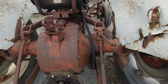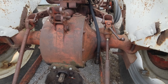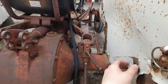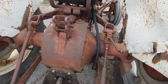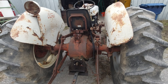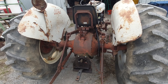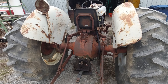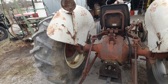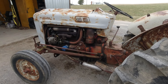It also has a functioning hydraulic input. The only thing with this hydraulic is it's a one-way kind of thing - basically a one-way valve. What that means is the hydraulic fluid is either pushed or pulled, and that's it. Think of it like a water bottle - you fill it up or you empty it, not both. Some hydraulic cylinders have an inlet and an outlet, one on top and one on bottom, so it's more of a continuous flow, but this one does not.